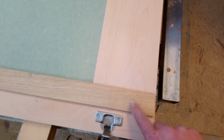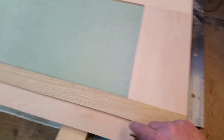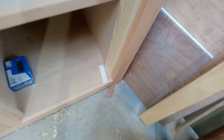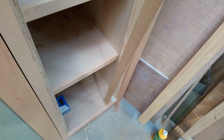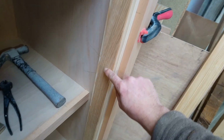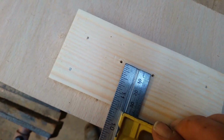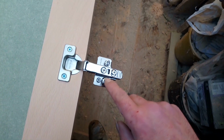But I made a measuring stick, marked bottom. They used to call them a staff rod. But I've marked them, squared them across so that I can work on both sides of the door. And I can put a packer the thickness that I want, that gap at the bottom. And I can stand that on there and mark off where my mounting plates are going to go on here. And I've set my square to that distance there. That's where the screws for this mounting plate went in.